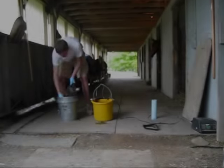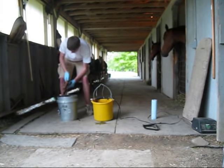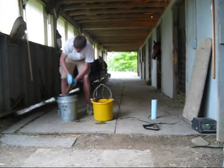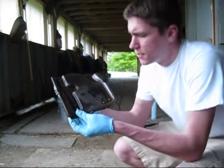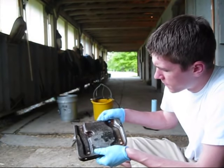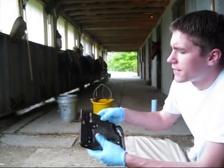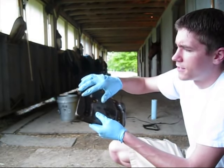So I don't think everything came out but you can really start to see — this was just solid rust and now right down here we're down to just the shiny metal. So it's not too bad. Again you can see the pitting in the metal where the rust once was, but this is more or less ready to just get a coat of paint. In my situation it was so far gone that I'm actually going to trim off somewhat so I don't have these jagged edges hanging off.